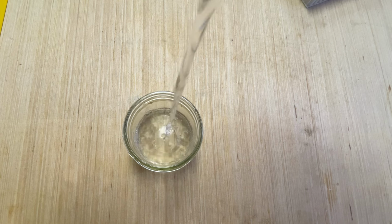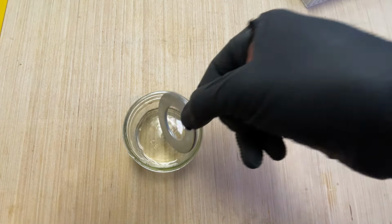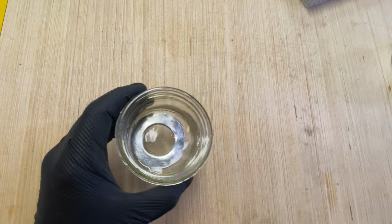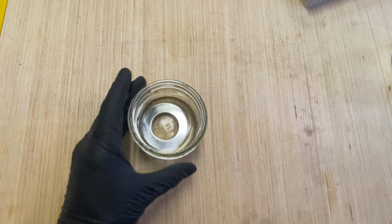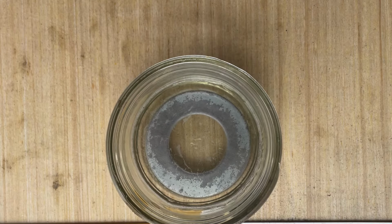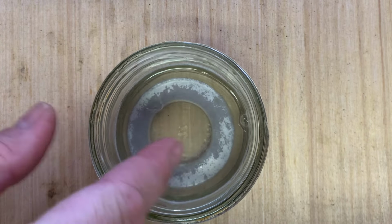There's a couple options when it comes to removing galvanized coating: sandblasting, good old sanding. I think using a solution of vinegar is probably the easiest. This is just 5% household vinegar in a glass jar. You don't wanna use metal, a plastic cup would also work. And then you just wanna cover it lightly because it's gonna release a bit of hydrogen, just a little, for a part this small, nothing to worry about. But I definitely wouldn't wanna put on a screw tight lid on that.